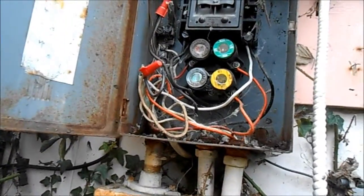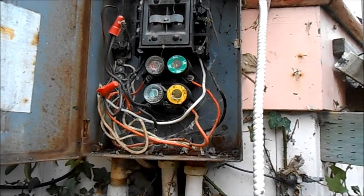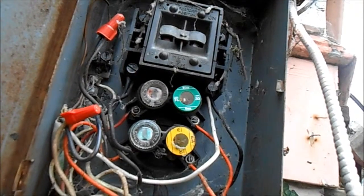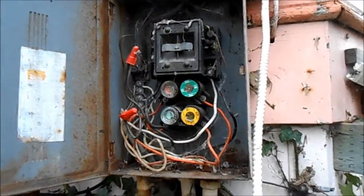So what I need to do now is check those fuses. We should have 220 volts coming off these two here — if we don't, then one of these fuses is probably bad. Well, it's either a loose connection at the box, which I tightened up, or there's a bad connection somewhere in the circuit.